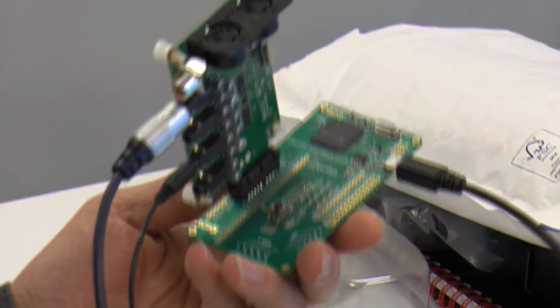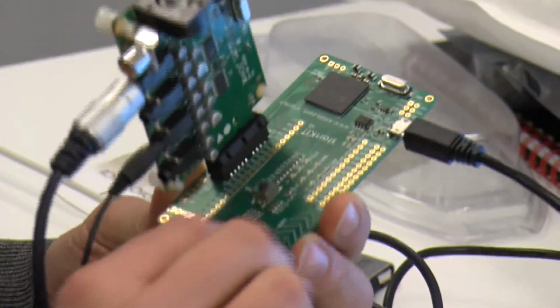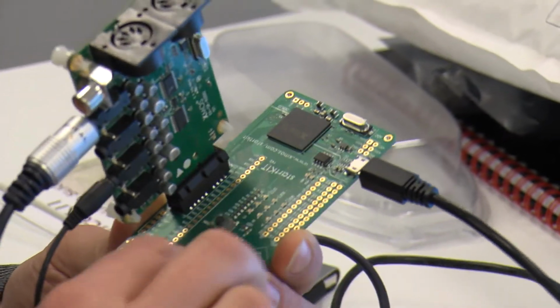It's supposed to be a flanger effect, but I have some issues with arithmetic overflow here, so I get clips and distortion. So some more debugging required, but I can already control the frequency of the effect. So here's the lovely distorted audio effect, and now I can use the capacitive slider to change the frequency of the sweep.